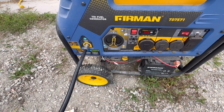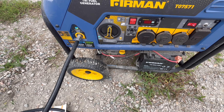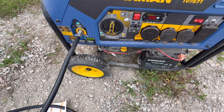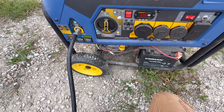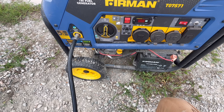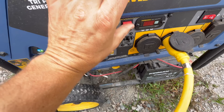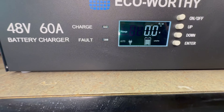This is a good — or maybe a bad — generator to test it on because this has a pretty bad total harmonic distortion. When I was trying to power my house years ago with it during a storm, all the lights were shimmering. I googled the THD on it — I think it was around 12 or 18 percent for this model; definitely not down at 5% like you'd want it. I'll plug into this generator and get it cranked up. That is a negative — it tried to start up and then had an error pop up: E11. It just keeps resetting with that E11 error.